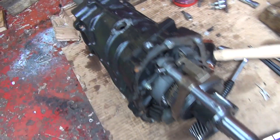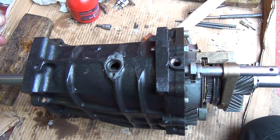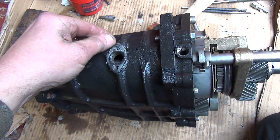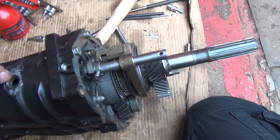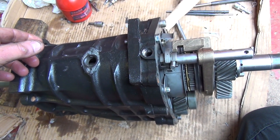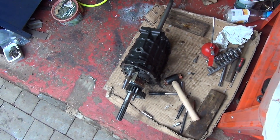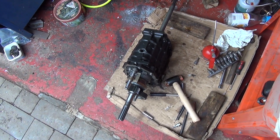I'm a little bit nervous because it's doing what it did last time I assembled it — whereby the tolerances are so fine that when I turn the input shaft in neutral, the output shaft is still turning. I'm hoping that when I've got the spool retainers in place and everything is lined up it will remain in a neutral state. I am a bit wary of it because it happened before and I don't know why. Hopefully we're almost there — but I said that about five days ago.